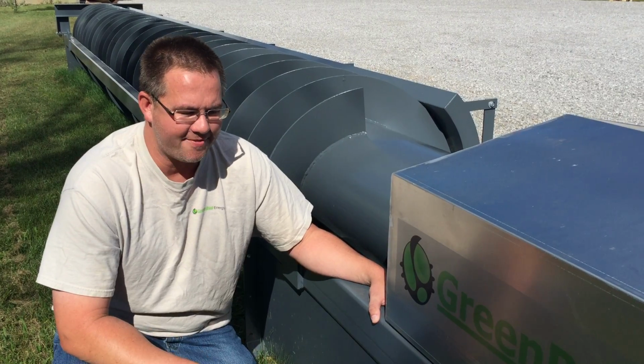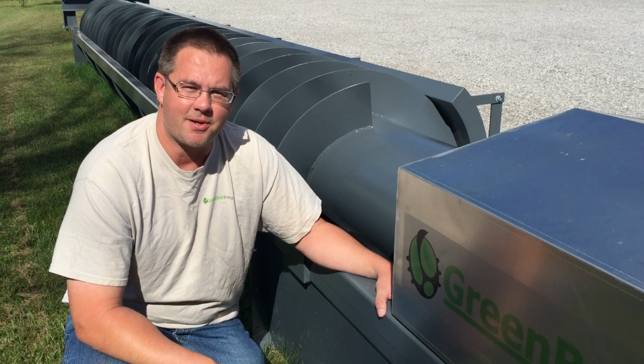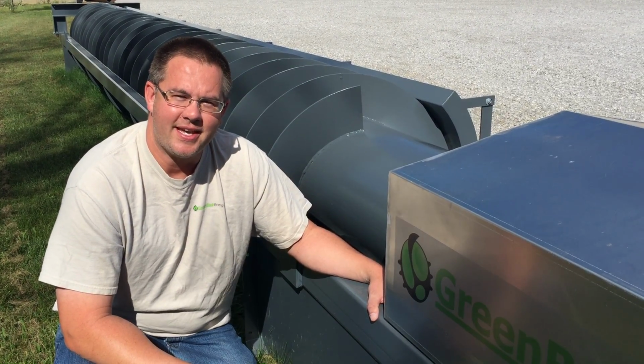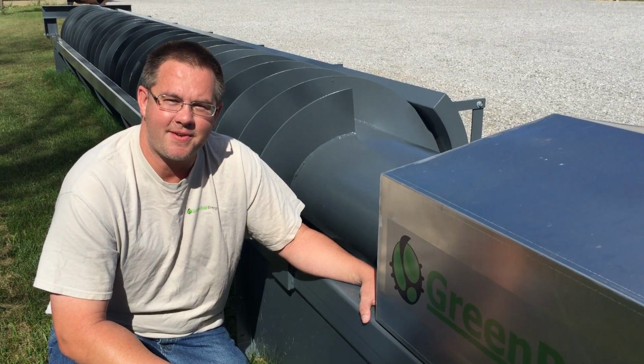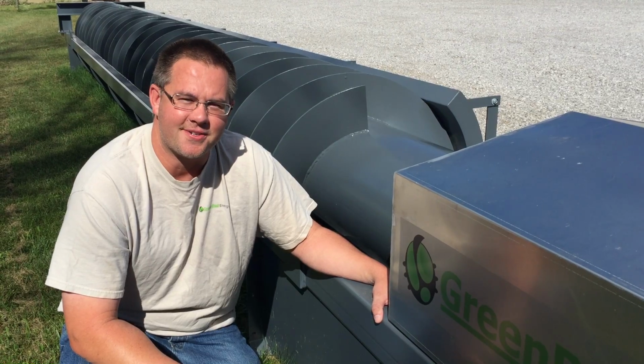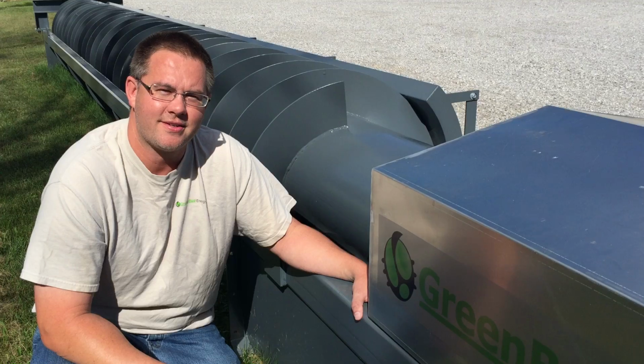In this case, they have more water and head than they actually need. So we're just using a portion of the head and flow that's available. We're using 3 out of the 6 meters. And we're using 150 liters a second, and they've got a minimum end of summer dry flow around 300 liters a second. So this screw will be able to run wide open all the time at 150 liters a second.